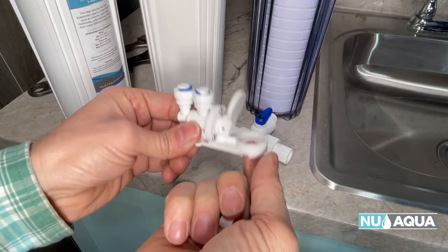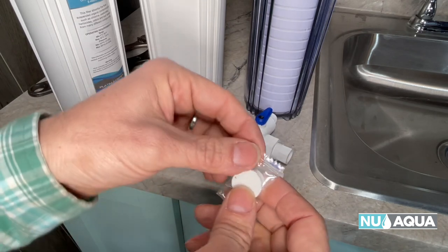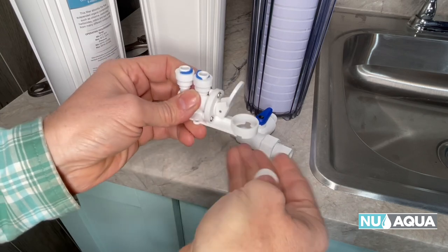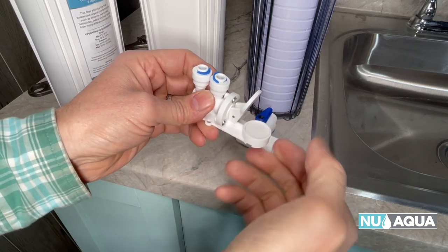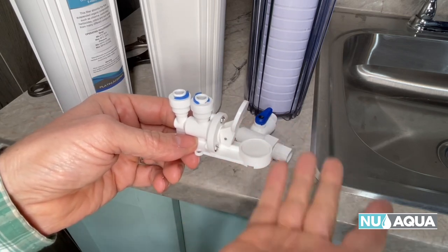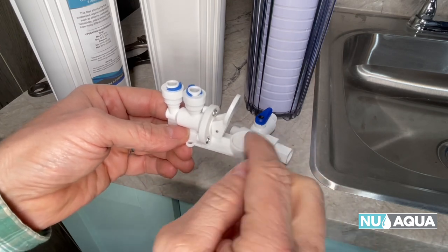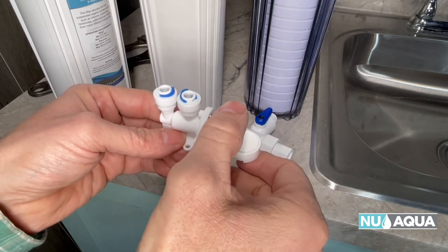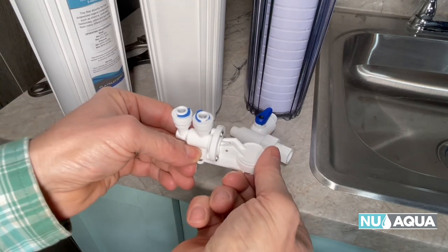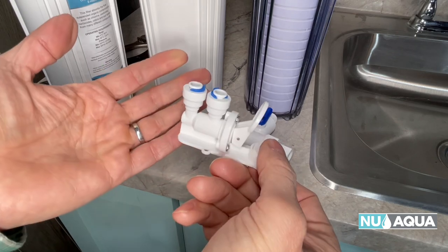By flipping up this lever, that closes the valve in here. It has this little cartridge that fits inside this tray. It sits lowest in your cabinet right on the floor. If a leak occurs anywhere in the system and starts leaking on the floor of your cabinet, this little cartridge will swell up and pop that lever up, which closes the valve. Simple and genius.